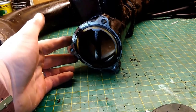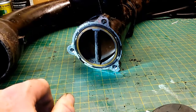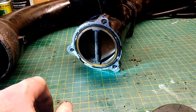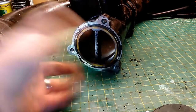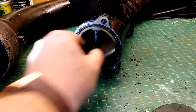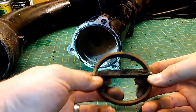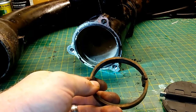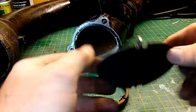The hardest part about replacing these shutters is basically getting to them, as these exhaust tubes are behind the engine. Under normal circumstances they're hard to get to — in my case I had to pull the engine. But once you get them out of the way and pull them out of the boat, there are basically three bolts, they come apart, and there's a ring that holds the shutter in there. It all just comes back out and you take the old shutter, whatever's left, and pull it out.